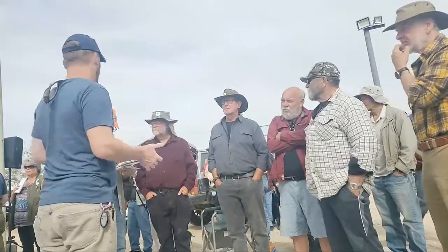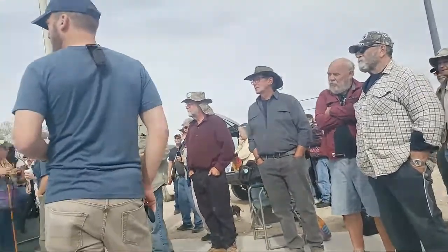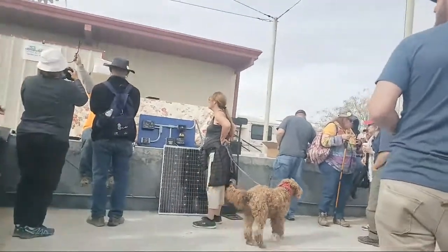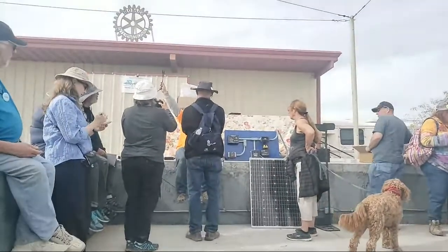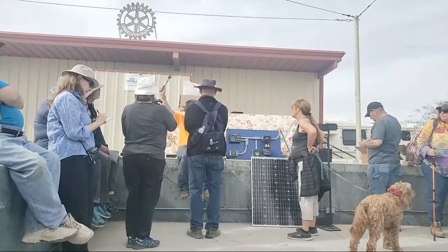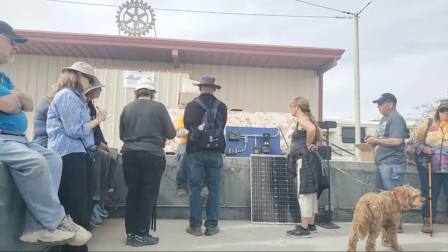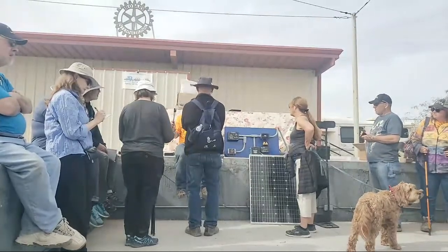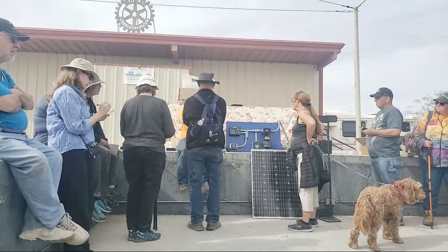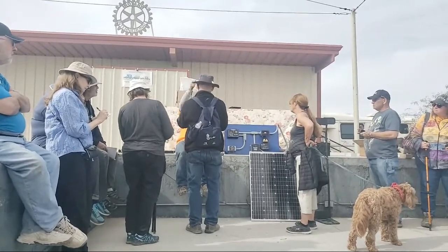This is a really great question I got here, so I'm going to repeat it. Do I have to use MC4 connectors? No, you don't. As a matter of fact, I don't recommend them because they're only 10 gauge wire, which, if you look up wire sizes, is severely underrated if you have 400, 500, 600 watts of panels. And also, two to three years down the line, this plastic is not going to hold up.